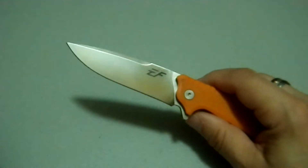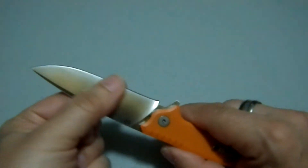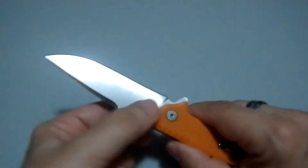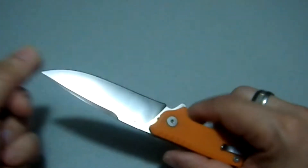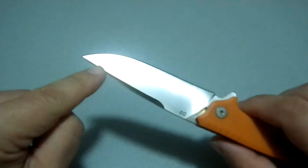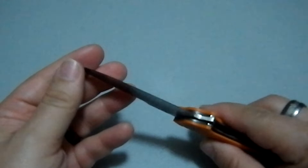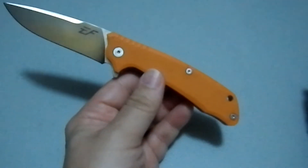Nice pop — it came out of the box like this. I did not have to do anything to get it to pop right out when I opened the box. This is a flat grind with an ever so slight convex as it gets to the edge. It has a nice feel to it, smooth, with a nice taper overall. It's a little bit thinner, so I'd consider this a medium-duty, somewhere between light and medium-duty blade design. It has a nice swedge and comes out of the box with a reasonably sharp edge. Decent grind, and I like the overall aesthetics of this design.